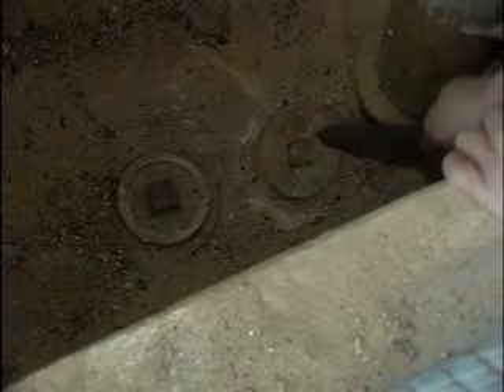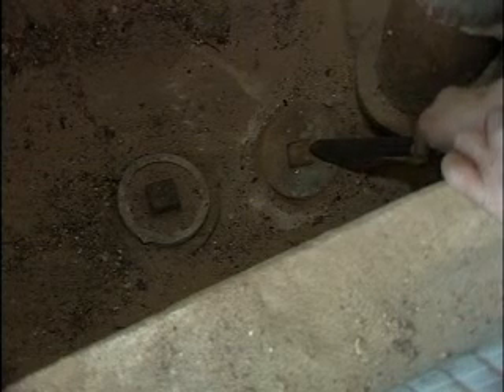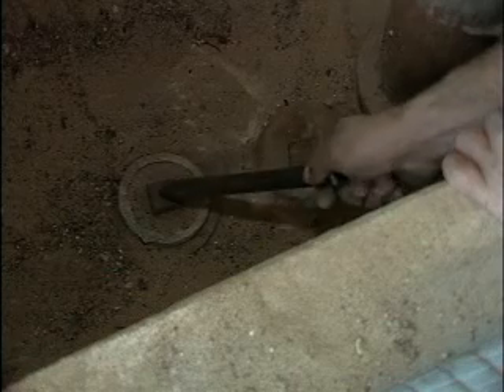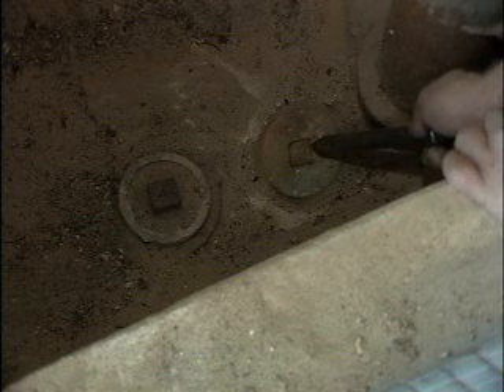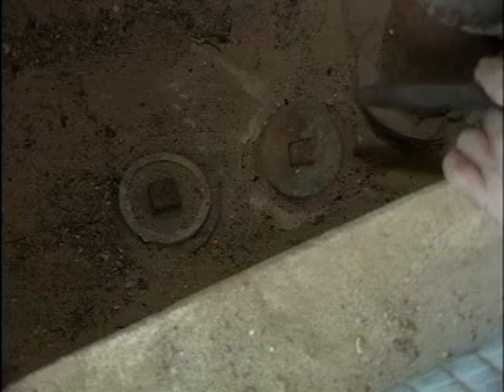Point to the house side of the house trap. That's where the sensor is going, on the house side. The other clean out is the street side, but we always install the sensor on the house side. What we're going to be doing is removing that clean out so the sensor can screw right in. Usually you have to break the clean out plug because they never screw out.